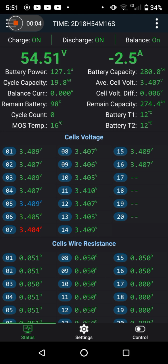So I'm being naughty and a little bit reckless. I've just burnt a little bit of energy off of the battery right at the top, not long, just a couple of minutes of the oven being on. I've tweaked the inverter settings up now to 58.4 bulk, which is the 3.65 volts per cell, and 58 volts float, which is 3.625 volts per cell. Tricking the inverter again into going into its bulk absorption float modes.